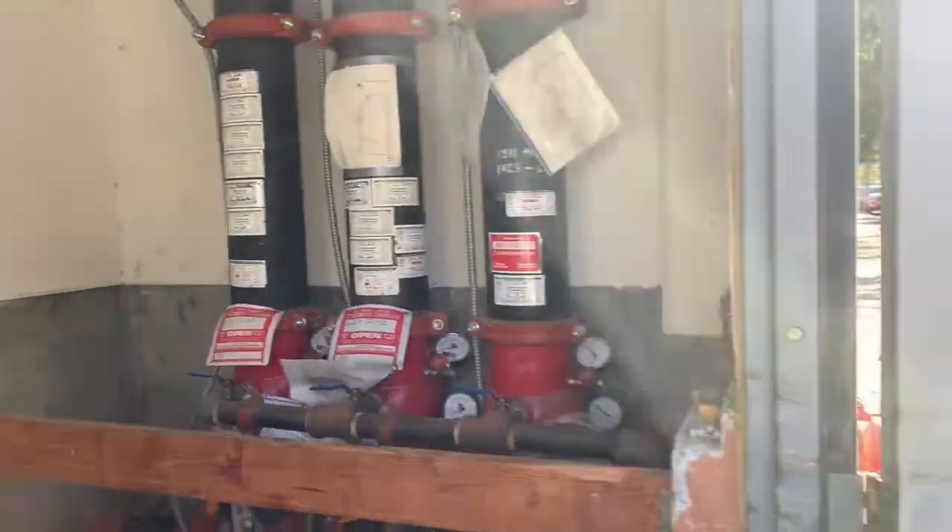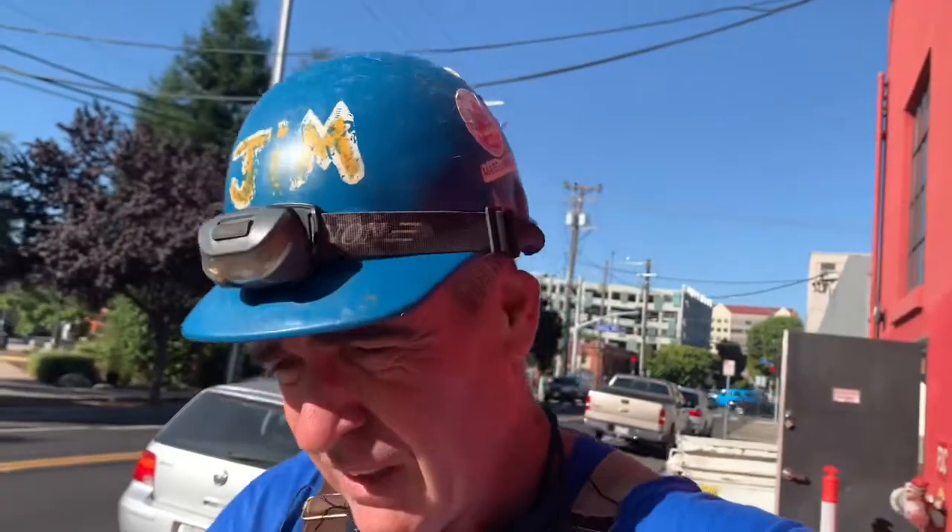It is apparent that I am feeling the fire sprinkler system, so I'm gonna show you what I did today at this undisclosed location. The problem I had was the inspector's test — the existing one was a male-by-female inspector's test. The one I got was female-to-female. Inside threads are female, outside threads are male — kind of like a male has stuff sticking out and female has stuff you stick in.